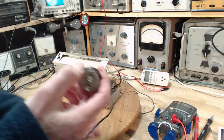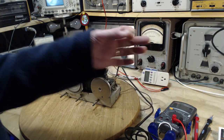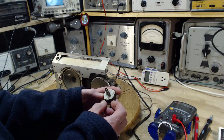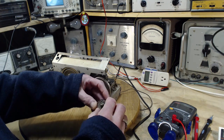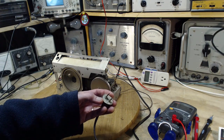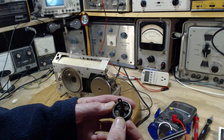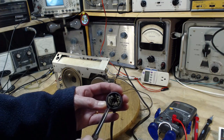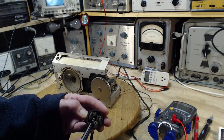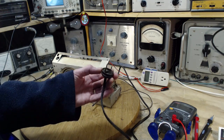Okay, let's take a look at the power cord here. Someone's hiding away. What's in there? So there's a cord done properly. And the wires are bent around the outside here. There's a number of loose strands. Pick them out. Looking for loose strands coming out and around. You can see why this kind of plug is just not acceptable by today's standards.